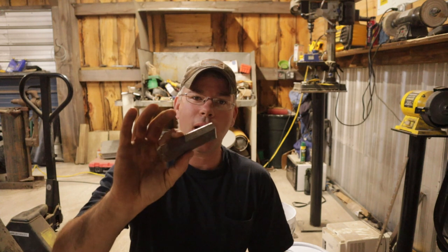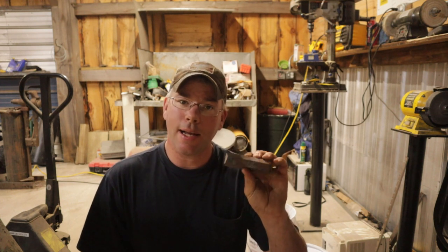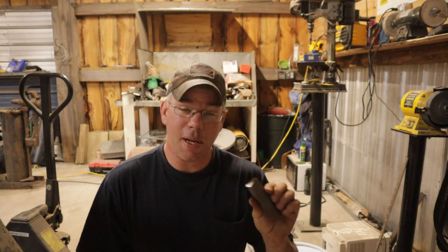Now there was a big difference in this stuff between this jackhammer bit and that supposed A11 steel. Had a whole lot of spark and a whole lot of sparkles off the end of them. Again, I have trouble deciding what words to use for that without sounding like a goofball. But this is definitely a high carbon content steel, or at least a carbon steel. Now you notice with just the mild steel, it has a pretty similar spark pattern to this stuff. So awful hard to test or tell just based on the spark test. Like I said, it gets you an idea whether you're even dealing with steel at all.